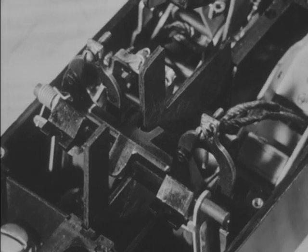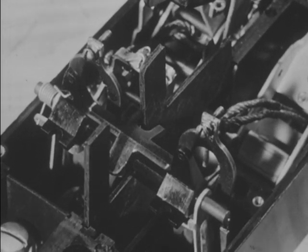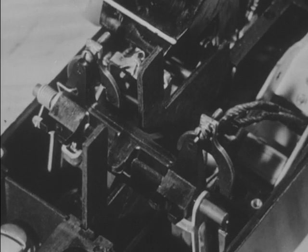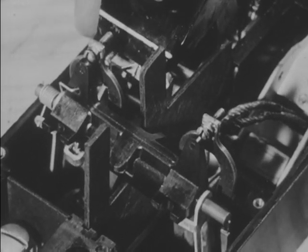Automatic protection against overloads is provided by thermostats built into the switch. When the switch handle is pushed up, triggers are set against the thermostats, so movement will release the trigger and open the switch.